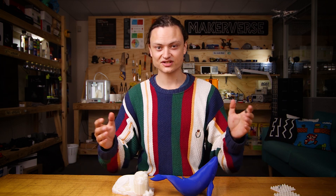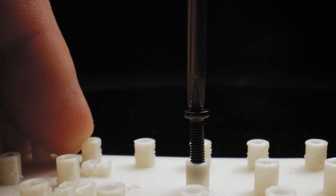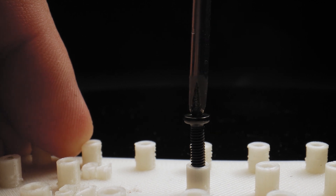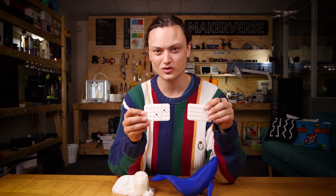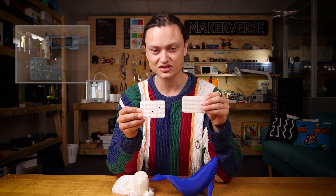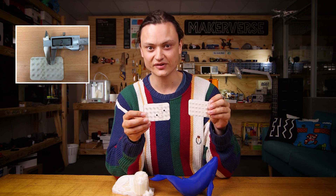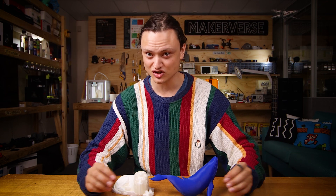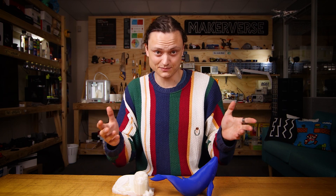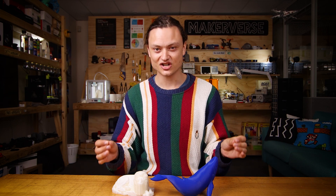This is all about ease of use — selecting the right intent option to get the exact result you desire from the 3D printer. Here are some test pieces I used to figure out which diameter works best with M2.5 screws when screwing them directly into 3D printed components; I printed these with an engineering intent profile and they came out exactly as they should. If you're interested in exactly what these profiles are doing, you can sift through the expert settings to see what's being changed — this could give you pointers to improve your own favorite print profiles. Our online write-up covers the current changes from the default intent profile to the engineering intent profile.